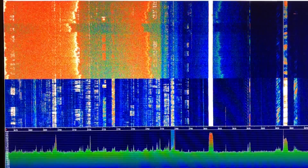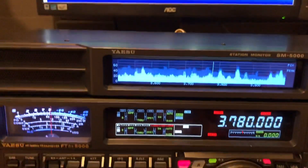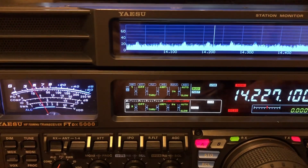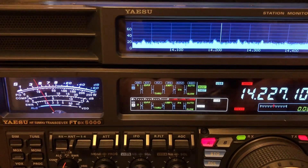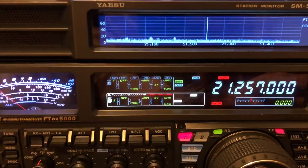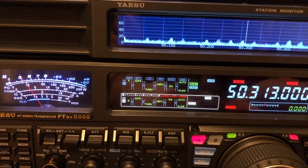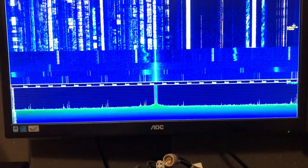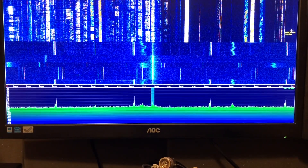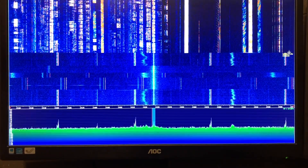How amazing is that - one bulb! We shall go and investigate in a second when it cools off. So here is the display on the rig. There's a bit of interference there - I think that's the usual interference I get. S3-4 rise, 15 meters drops right down, 10 meters, 6 meters - you can see I've got some spikes, they're always there, but nothing like what that was. There's 20 meters again. But look at that - 80 meters, there goes the interference off the top.